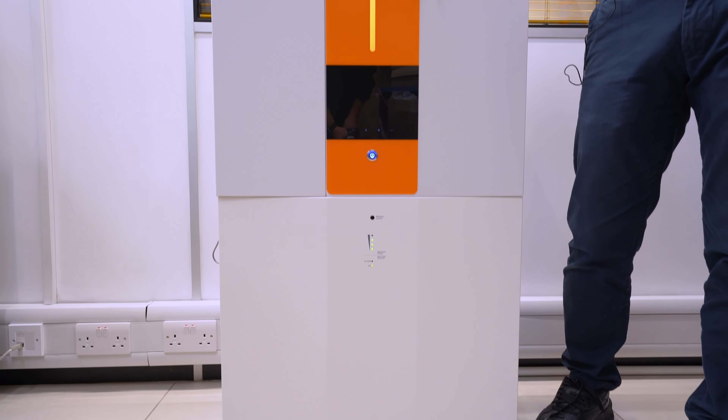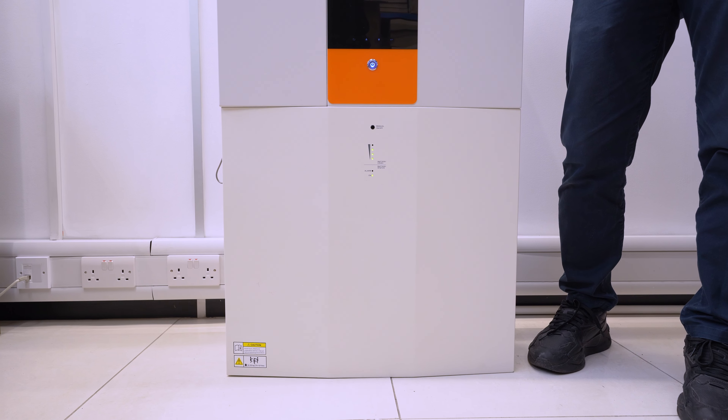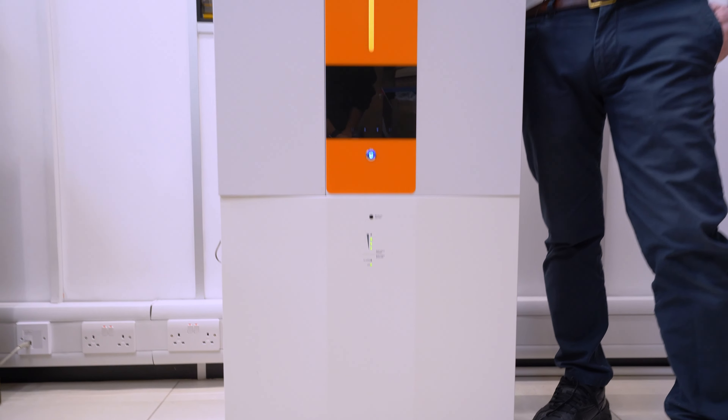The all-in-one energy storage system operates in hybrid mode in parallel with your grid, in off-grid mode, and — very important for customers with a feed-in tariff system — you can still operate this system in parallel with your existing photovoltaic solution. The battery is specifically designed for this unit and you cannot mix and match with other lithium-ion batteries. The life expectancy of the battery is 8000 cycles and almost 15 to 17 years. If you want to find out more, visit our website voltaconsolar.com. Thank you very much for watching.